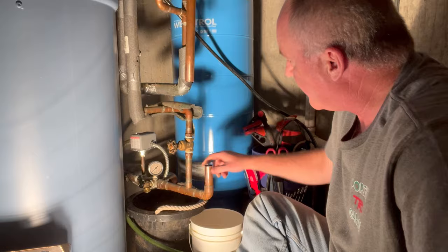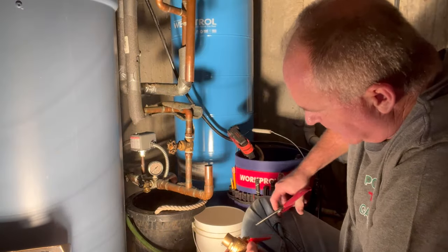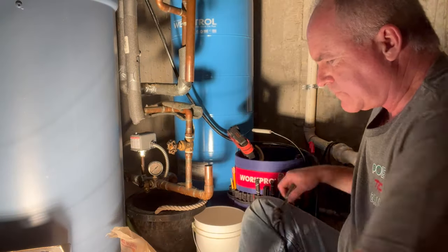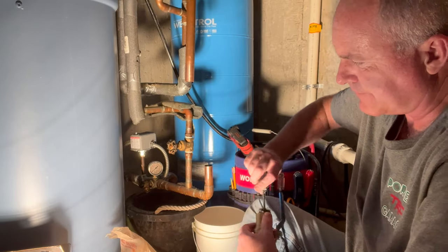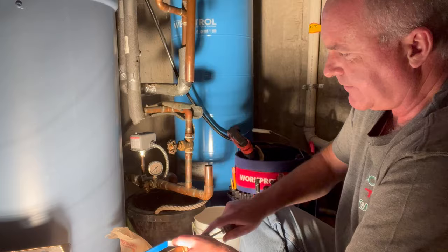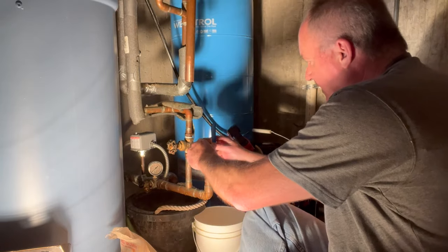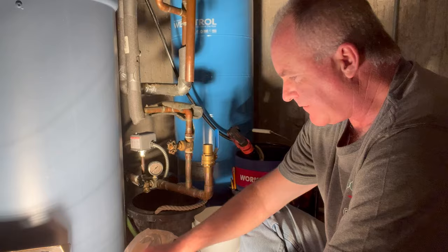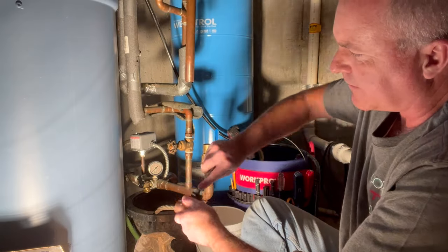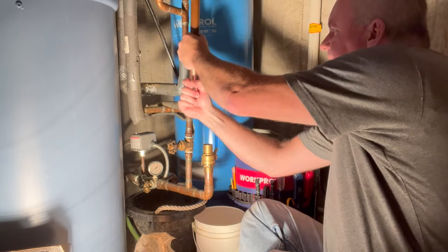Got those cleaned off now, top and bottom. So that should fit. There we go. Make sure you clean the inside of the fitting — inside of this fitting, those sides here. I'll get the flux on later; I just want to dry fit for right now. So there's that one. Let's get the inside of all of these parts. We'll get flux on that in a minute.